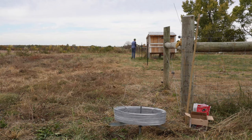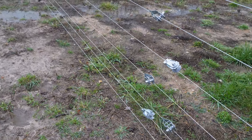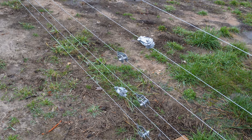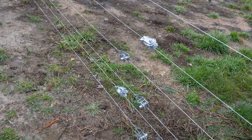Unfortunately, the wind picked up and I wasn't able to complete the process of recording myself building this fence, but I will walk you through the final steps and show you the finished project. I pulled the other five wires the same way I did the first two and alternated the spacing of the strainers so it would reduce the likelihood of them getting caught up on each other — because if something can happen, it probably will, so might as well take some precautions.